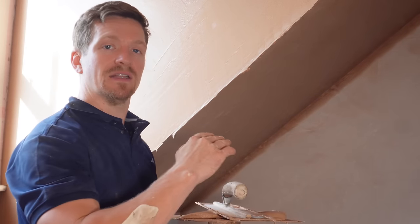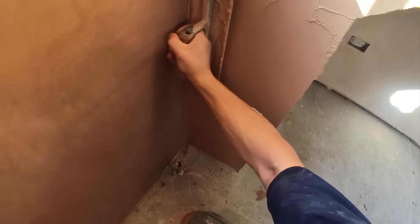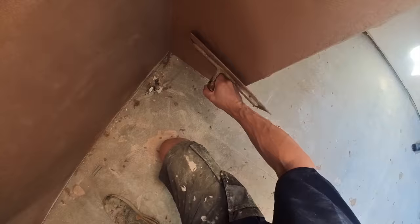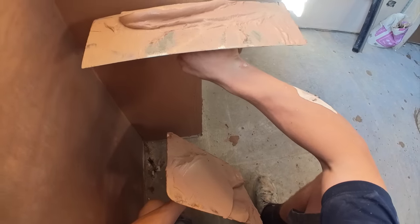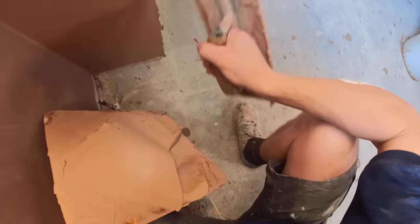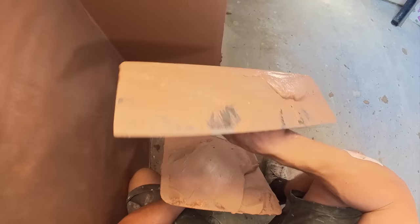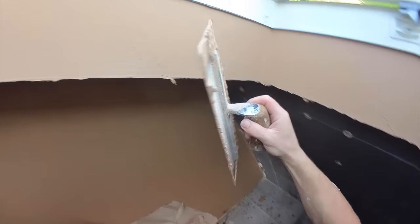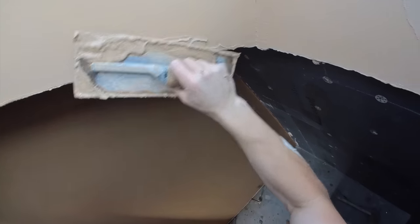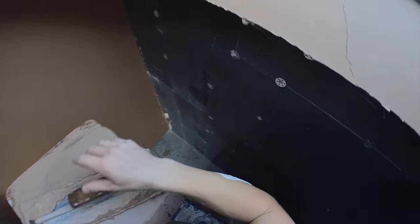Now I'm going to talk about how to flatten it to make sure we continue this level of flatness. Focusing on the edges, I'm going to start horizontally to keep the edges nice and tight. I take a bit of plaster — not needing a lot — and aim for the centre of the bead, run up it, then trowel into it. You want to make sure it's paralleled off. Looking down, coming up, filling any areas that are a bit low. We're flattening by running along the bead, not through it — that way we fill any gaps and make sure the whole area is fully covered with no dips, giving a nice flat line running all along the reveal.